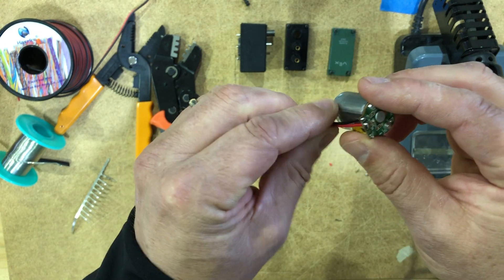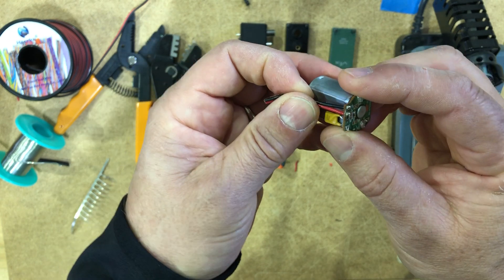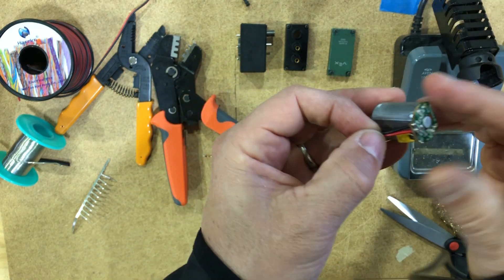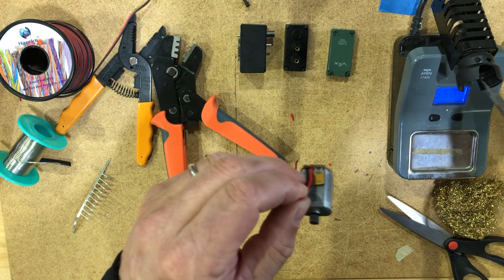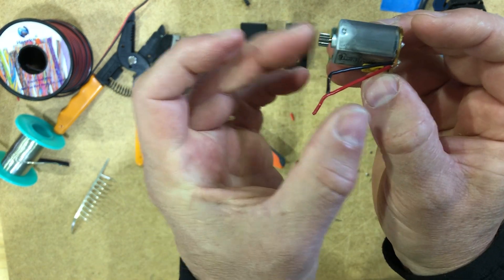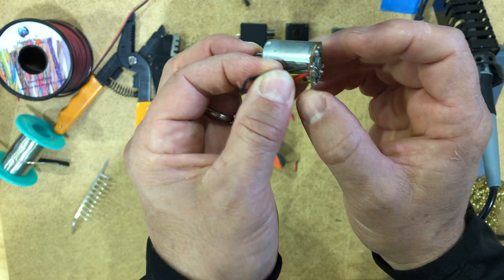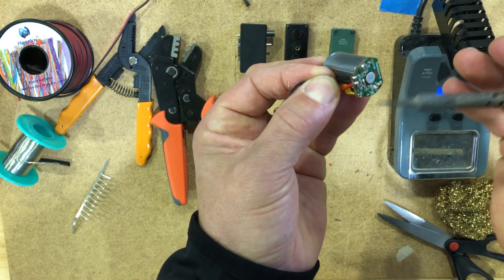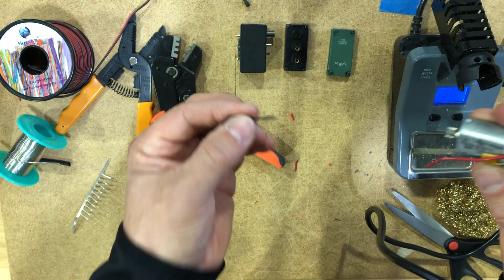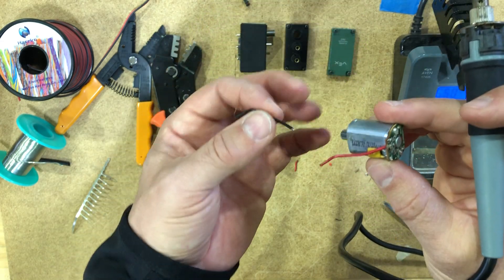Our strategy here is to melt the solder. On the bottom of the motor is a control board, and what we're going to do is replace the entire wire — remove the wires by actually melting the solder on the PCB. We'll do it one at a time. I'm bracing the bottom of the motor with my finger and grasping the black wire with my other finger. Notice we're remembering that the black wire goes on the outside. Then just hit the solder with the soldering iron and it came right out.